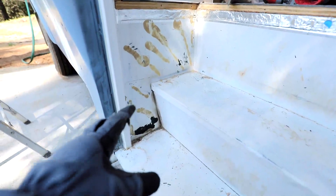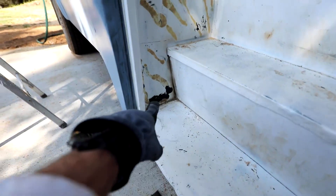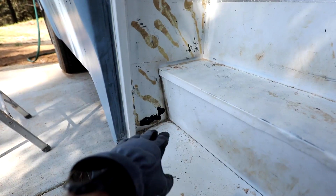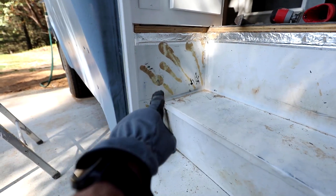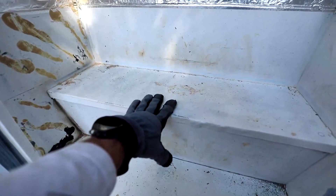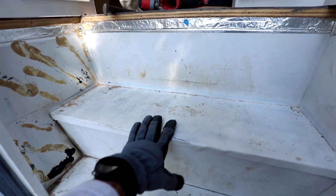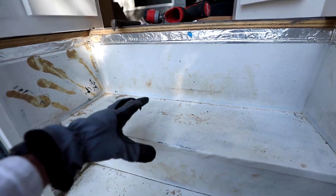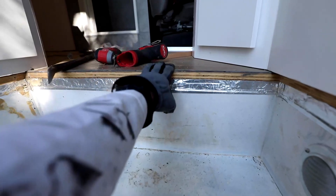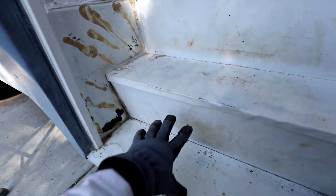In the past couple months, because there was no rain protection on the bottom of my door, this step would have water sitting on it when it poured. A piece of wood used to go all the way down to the bottom and would just sit in a puddle for a day at a time. So I cut out the whole piece and what I'm going to do is line the sides, backs, and floors of all these surfaces with my leftover go board and waterproof it just like I did in the shower. That way if it gets splashed or rained on it's easy to clean and I'm not worried about water soaking into this area and causing wood problems. The go board will be the backer and I'll use leftover shower tile for the backs and sides of those walls.